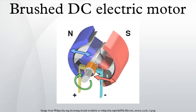An electric locomotive or train would typically have 4 motors which could be grouped in 3 different ways: all 4 in series, 2 parallel groups of 2 in series, or all 4 in parallel. This provided 3 running speeds with minimal resistance losses. For starting and acceleration, additional control was provided by resistances. This system has been superseded by electronic control systems.